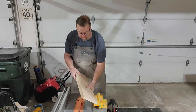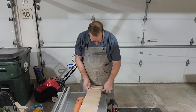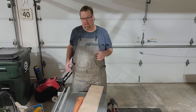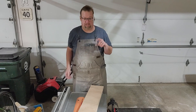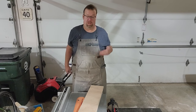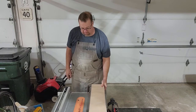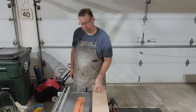So what I have here is two pieces cut down to about six and a half inches. I like my cleats to be two and a half inches from the bottom edge to the top of the bevel — really I prefer over three inches. The reason is I like to use two screws, and if they're too close together going into the stud, you're not getting as much holding force. Somewhere in that three-inch range is probably the perfect size for a cleat. Now we're going to cut these right down the middle at a 45 degree angle, and that'll give us two cleats out of every board.